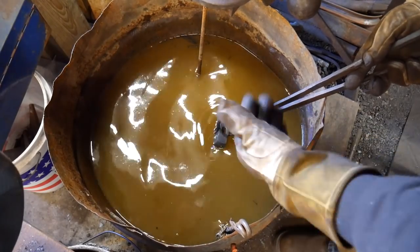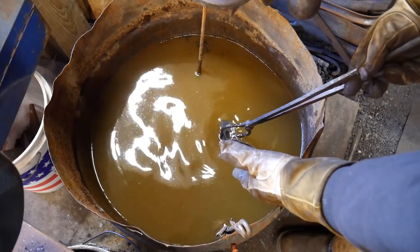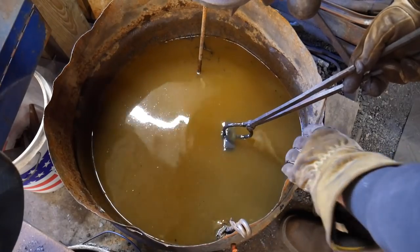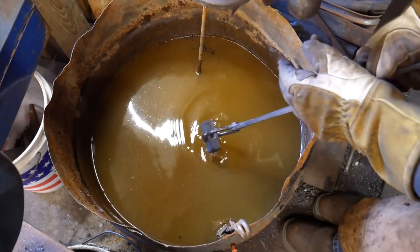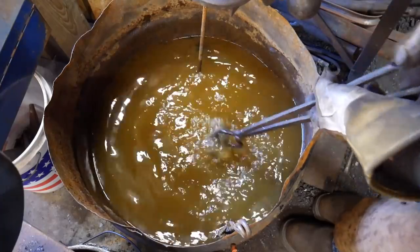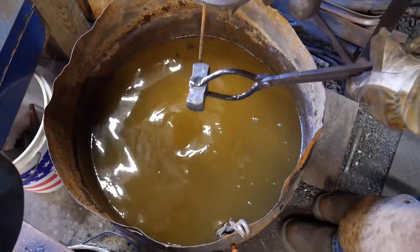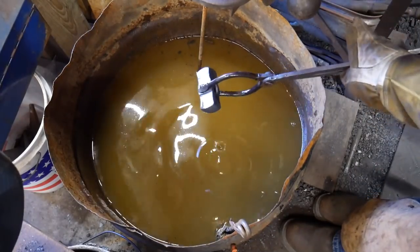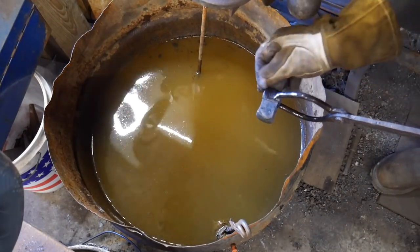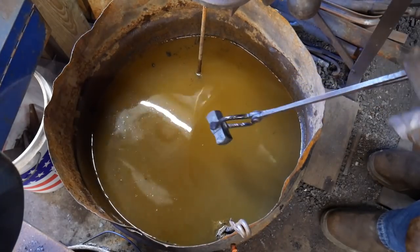This is ambient temperature water. It was fairly cool last night, so the water is fairly cold. If you're worried about breaking steels like this, you can always boil some water and quench it in hotter water — I've heard heating the water can help, though I don't generally worry about that. The hardening process is a very severe process for a tool. Let me get you out of here and then we'll take a look at how this hammer looks up close and personal.